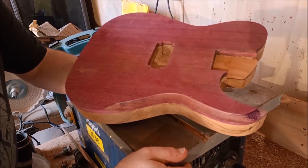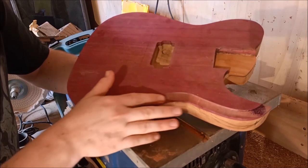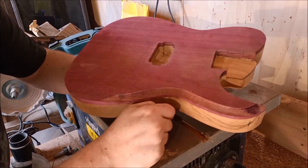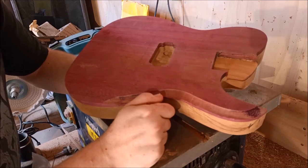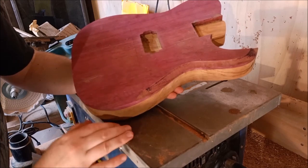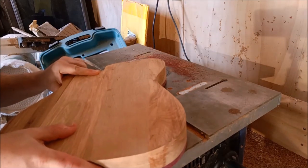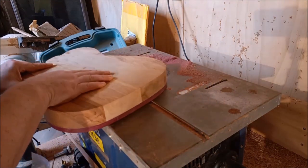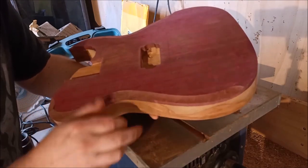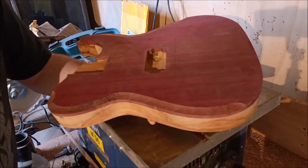It's difficult to compare it to anything else because I've never routed Purple Heart like this before. I have used a cove bit on the elm-topped Strat, and that wasn't as smooth as this even though it's a softer wood — so this is quite impressive. It is somewhat difficult to do on a router table because you can't see where it's making contact, so it's difficult to be as precise, which does raise a safety issue. But that's router tables in general, unfortunately. This part I think is going to be the most challenging because I'm going across the end grain, but it can't really be avoided, so let's just press on.